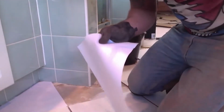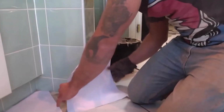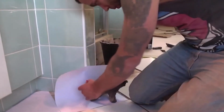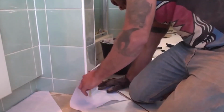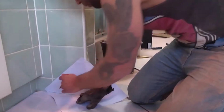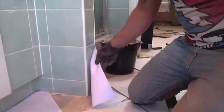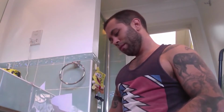And I say, no, you just need a piece of paper here, right? You just take your paper and you kind of, here, let me bring you back down. And you just lay it like it's a tile. There's my corner. You get this all straight here. Lay that out straight. Corner, corner. Easy. Then you just cut it out. You lay it on top of your tile. You got a template. Boom, you're done. A lot of people are like, man, that's pretty smart.